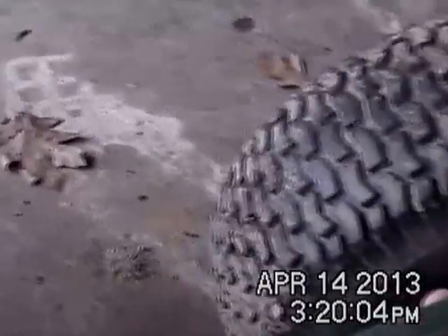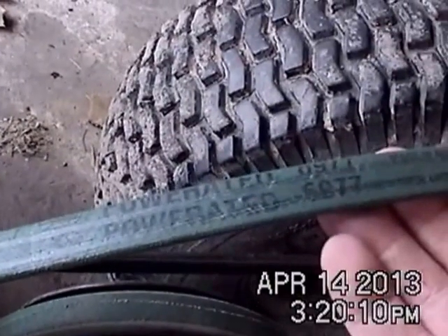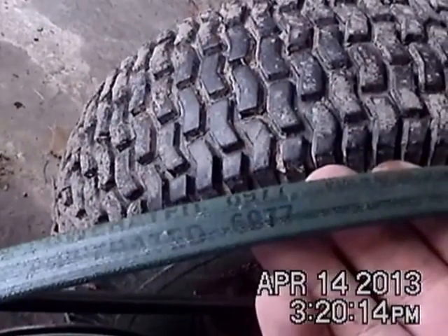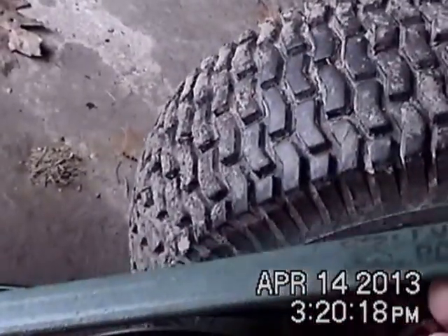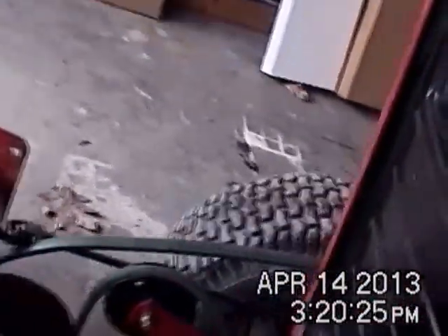Let's see what belt this is. This is a green belt for reverse bending over pulleys - they're extra heavy duty. This is a power-rated Gates belt, model 6977, made in Mexico. It's holding up quite well. So that's the belt make and model for a Gates belt that you would throw on a 195 if you had a tall chute blower.